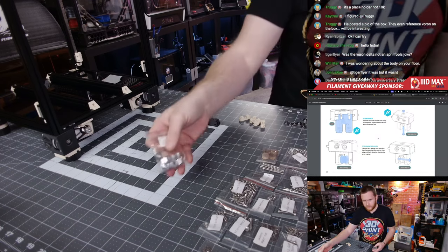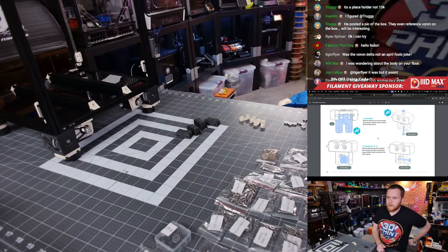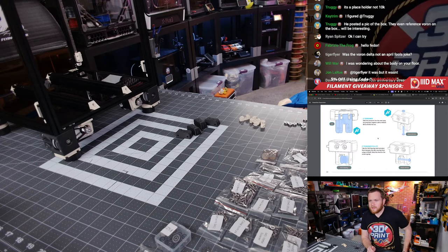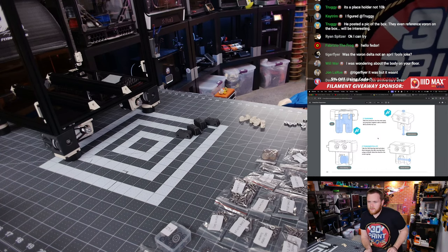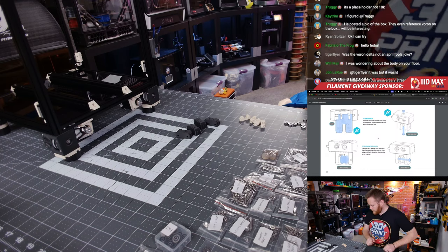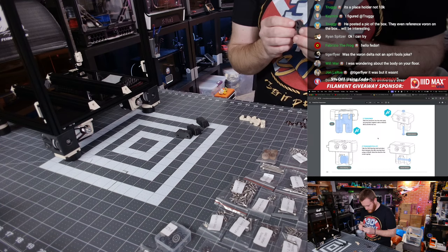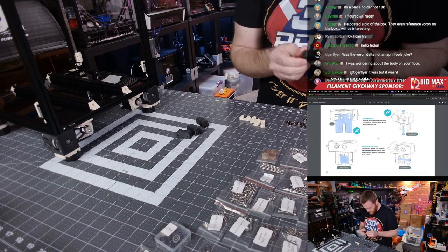These toothed ones are going to be for the gantry. Slide the tensioner into the main body, secure them together with M3x16. Take the F623 bearing, stack, and place them between the idler, securing them using M3x20. Obviously, those hardware numbers are not going to be accurate.